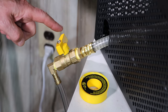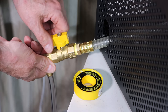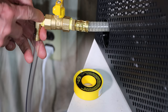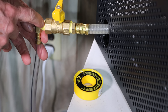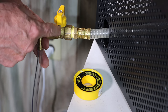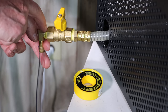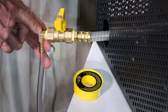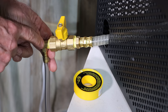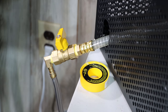So there we have it. I've put a link to where I purchased the valve and the Teflon tape. That position is closed, that's open — it releases the vacuum. I've also noticed people talk about the fitting right here, but anything past this cutoff valve cannot cause a vacuum leak. If the valve is leaking, it doesn't matter what's on the end because the tube is still open. So that fitting right there — it doesn't matter if you put Teflon tape on it or even leave that part off. It's not going to affect whether you hold vacuum or leak it. The Teflon tape really doesn't matter there, but I put some back on anyway. Make sure you've got a good quality valve and use Teflon tape rated for gas pipelines.